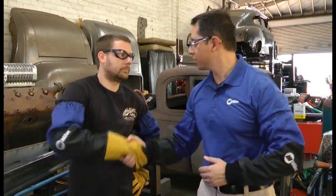So just to recap some of the things we went over today: one, we chose the TIG process because the end weld itself is a little bit more malleable. We prepped the material with a bevel groove just to get full penetration on some thicker material, and we used the TIG process because it gave Sean better control over the heat to prevent warpage. Thanks a lot, Sean — appreciate all the education. See you guys next time.